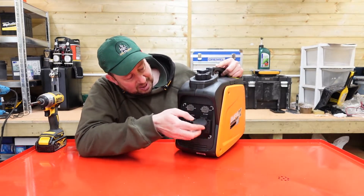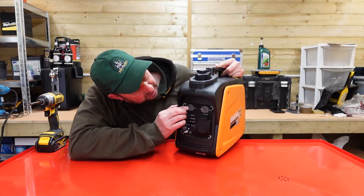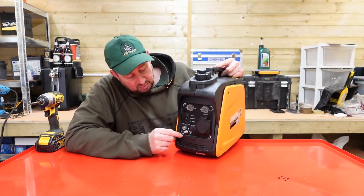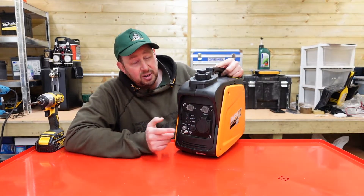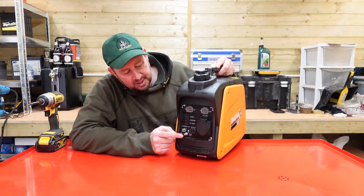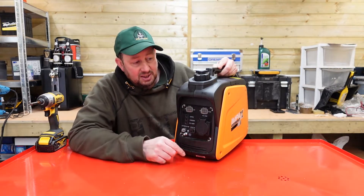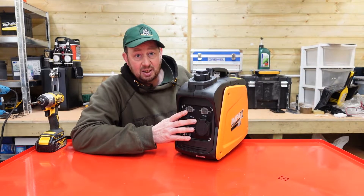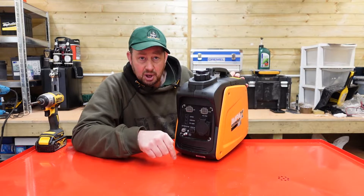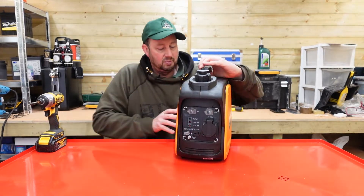Make sure there's no problem with that, everything's fine. We've got the machine in the off position, the eco in the off position as well. If you're going to run this, you should really be connecting an earth wire. Not many people do, but this is insulated from the ground on rubber feet underneath. We need to have this little wire off to an earth rod and push it down. If anything goes wrong, instead of the electricity trying to discharge through your plug socket, it will just go down to earth and keep you safe.